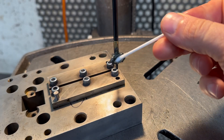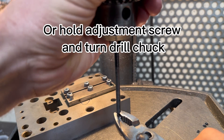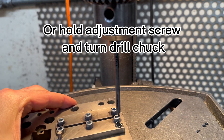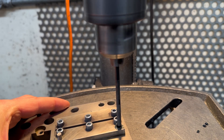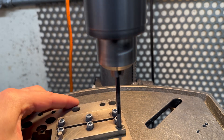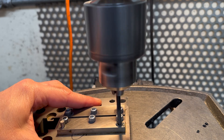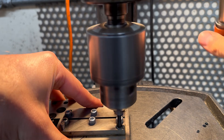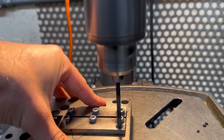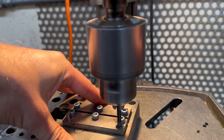Next, I will add the compound to the lap. To adjust the lap to the proper size, you need to hold the drill chuck from moving and then take some pliers or a crescent wrench and turn the screw until the lap is the size you want. You should feel some resistance between the lap and the workpiece. If you don't feel any resistance, make the lap a little larger. The smaller the lap, the more rapidly it will wear away, so constant adjustments are necessary. If the lap is squealing like a pig, then it's too large and you need to adjust it a little smaller.